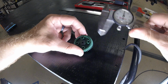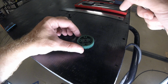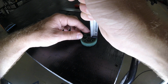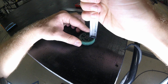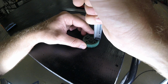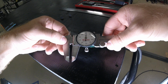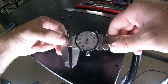Now if we needed to get the depth of this gear, and we couldn't use anything else to get it, we didn't have a CAD model, we would get our depth by using the depth indicator on the bottom of the dial caliper. So that is the slide that's going to come out. We're going to be able to roll our thumb screw down until we have 2 points of contact. Then we'll be able to see that it says 0.2, 200 thou, 0.2.